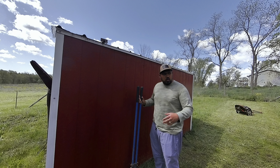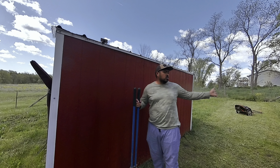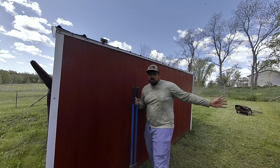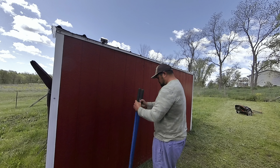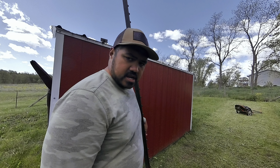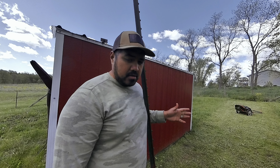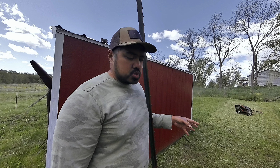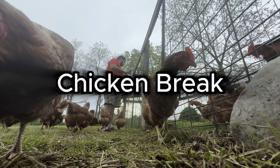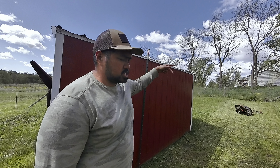The next step is pretty simple — we're gonna dig a hole that follows this post. We can use the old fence as an actual gate so we can still close them in if we ever wanted to leave them in the old yard, but they still have full access to this new yard. We've already run into an issue — we keep hitting a huge stone over here, so I'm gonna see if I can just skim past it with one of these old posts and post-pound around it instead of putting in one of those old-school wooden posts. We're gonna pound about two or three more down that way for the integrity of the fence and we'll just keep moving from there.